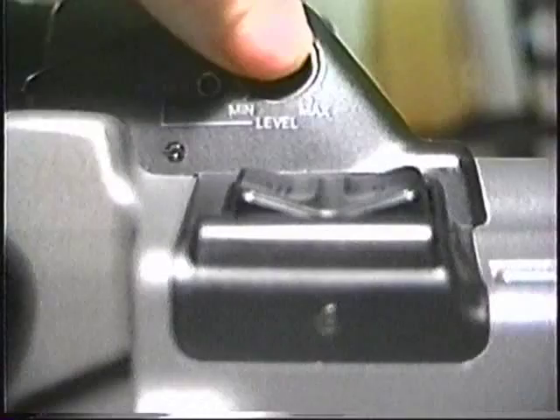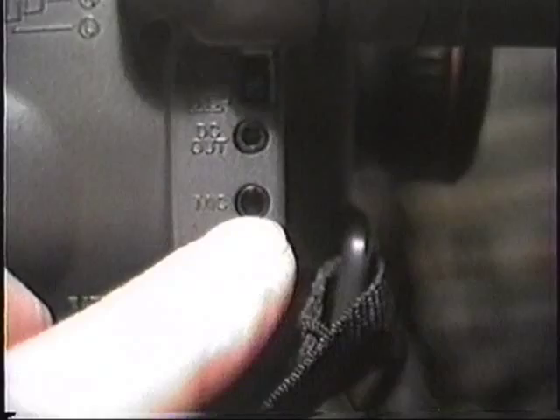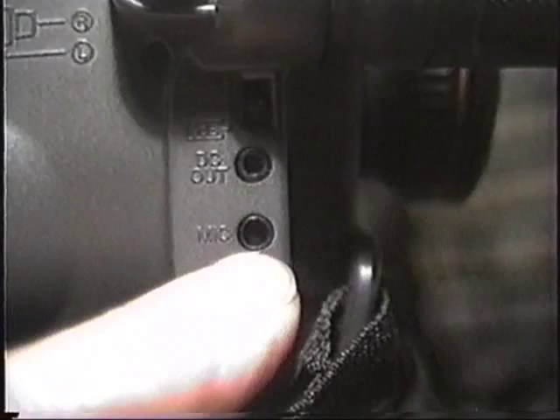And I know you're going to ask, what are these things down here? Well, this is for an external mic. And this controls the external mic input volume level, which is nice. DC out for external power for the external mic. And this is an ATT switch for attenuating — minus 20 dB or normal — so you can turn it down if you're in a really noisy place. And the battery goes underneath there, where you have a little wire coming out. That's like the AC-type battery like you have for your camera as well. So that's this side of the camera.